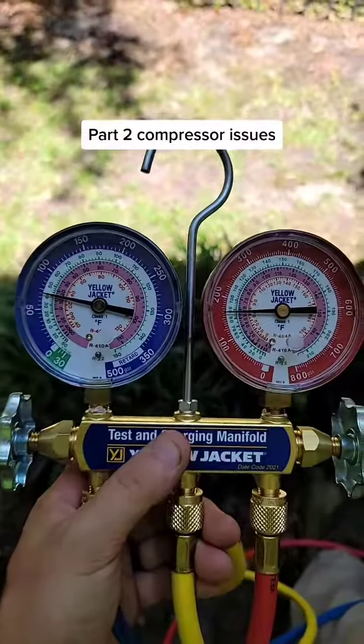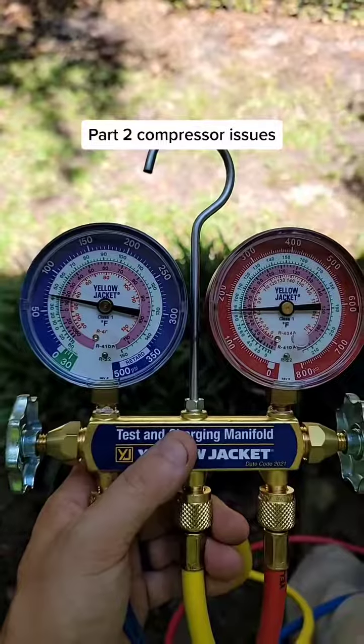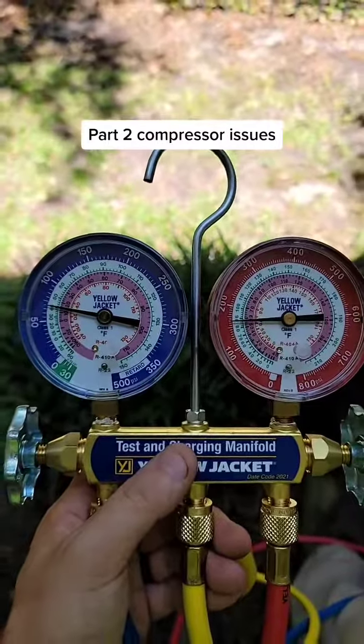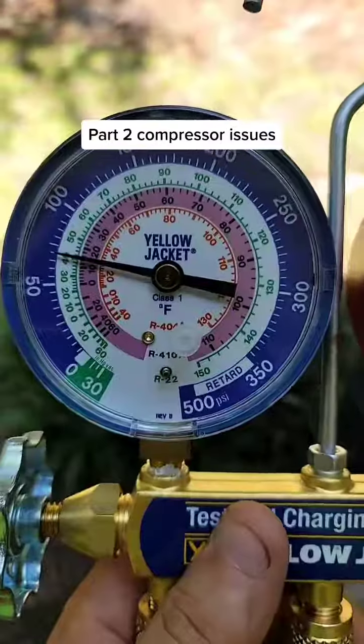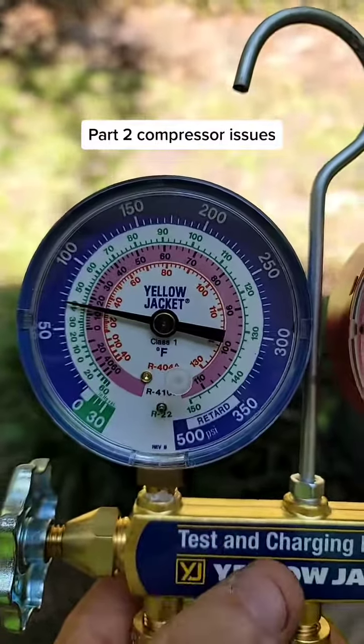Part two. We put it all back together. The compressor is looking like this — it actually engaged. But now we're getting these readings where a typical R22 would read on your gauge on that side, but on this side it's really low — it's way below 200.